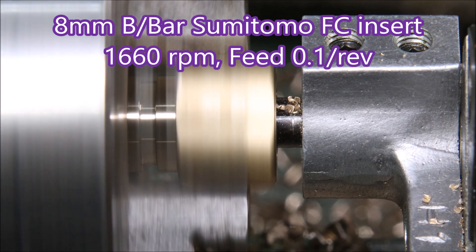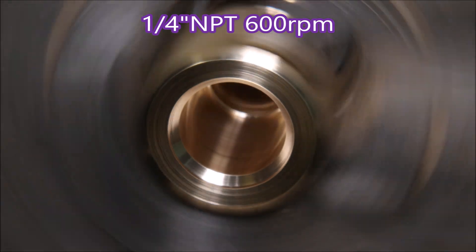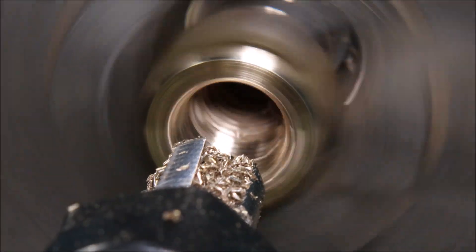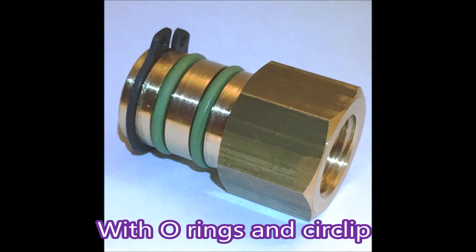I like to think it takes less torque than just a straight 11mm drilled hole — I may be wrong, but I really don't care because that bored tapered hole really does give me a nice thread. And if you're wondering what this fitting is for, it's to take coolant to a converter in an autogas system.